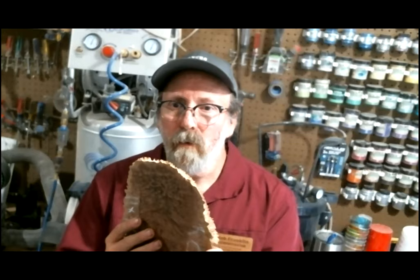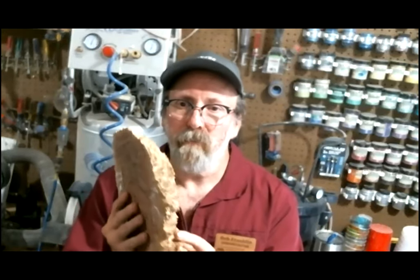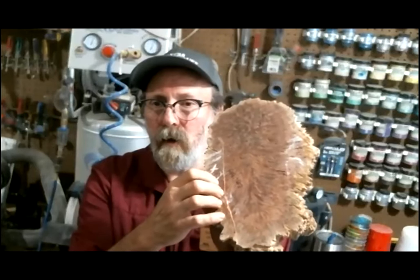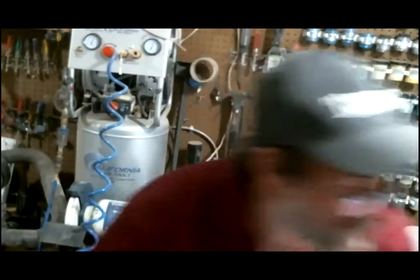Okay. See, they're paying attention, Bob. We got just a moment or two to go, if we can. Sure. Just talking about burl real quick. This is red mallee or brown mallee burl. Any of the mallees or most of the Australian timbers are so dense, they don't take much stabilization. They won't hardly gain any weight. So if you don't have the possibility of stabilizing something, but you want to cast burl, I would recommend something like that. Something that's super dense. Because they're not going to expand and contract with moisture. They're so dense. But let's field questions.